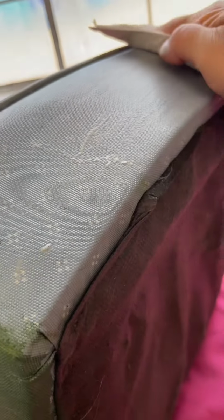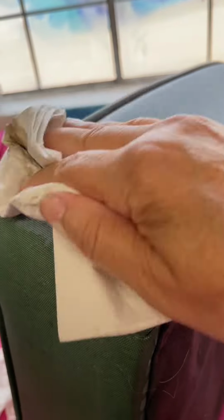But more than that, it gets off the shine because this is basically painting plastic that you're going to sit on. So we really need to degloss this thing. And we got most of it off. We did. So for this job, I'm using Miss Lillian's Original No Wax Chalk Paint because it has a built-in sealant.